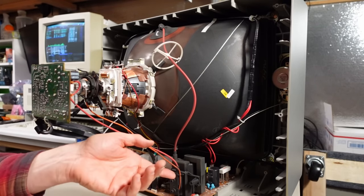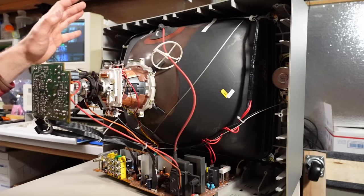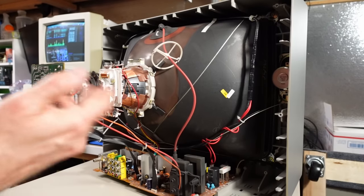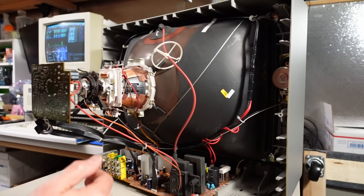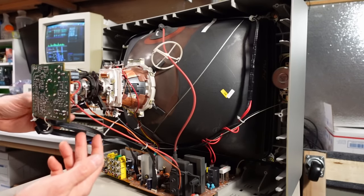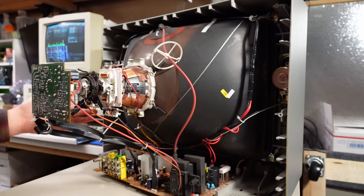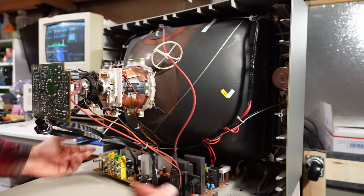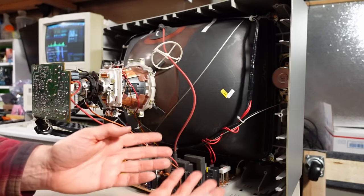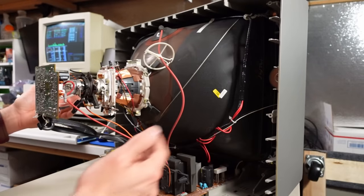Now, in some televisions, you can disable that in the menus. Other ones, you can disable it in the service menu. But I think on this television, there was no way to disable it. So I started digging around in here, and I did not make a video on this, obviously. And I remember I figured out what wire it was on the neck here, and I disconnected it. And when I cut that wire, that feature was disabled entirely, which, yay, made the picture a lot smoother, a lot more, well, realistic. None of this fake artificial sharpening, which they started doing, and I absolutely hate.